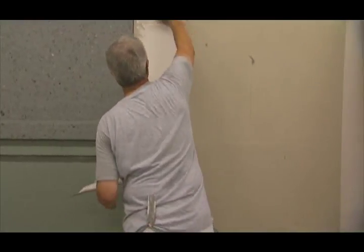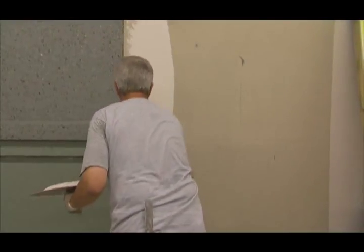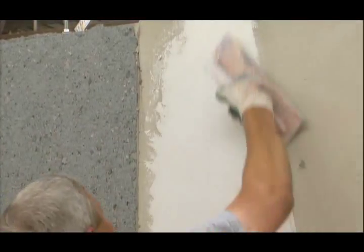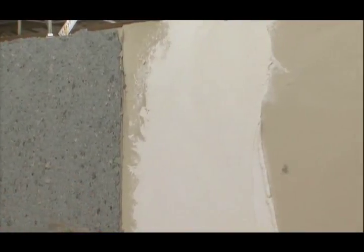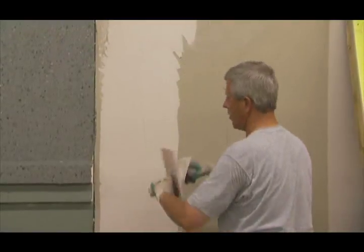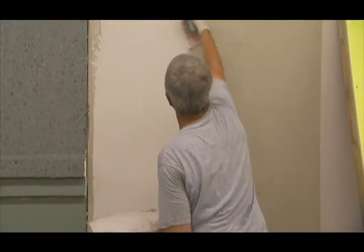When you're coating that surface, you'll see it's a very fine aggregate. When I'm coating that surface, I've got my trowel up on angle — notice it's not flat. I'm pulling it down just as tight as I can get it, so there's no fat or anything else left to it whatsoever.